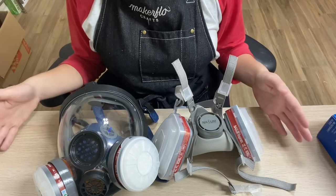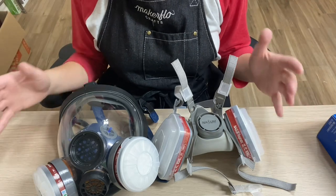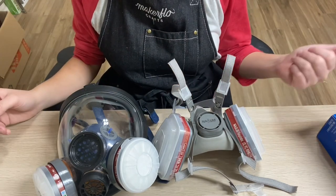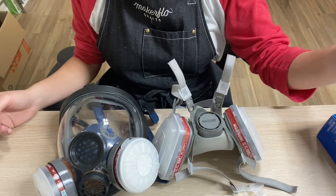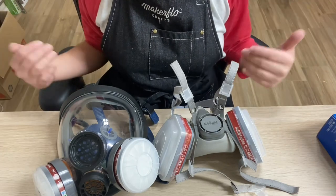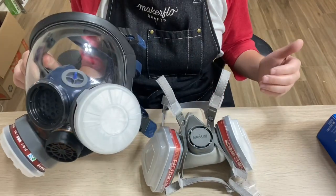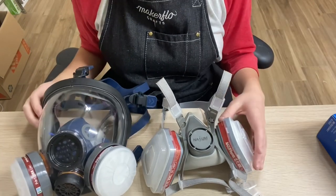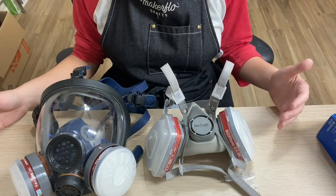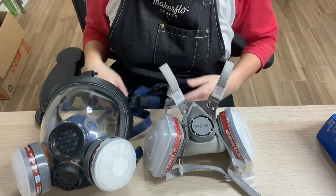While working with epoxy, a lot of people are either allergic or their skin gets aggravated. I invested in two respirator masks about a year in. I actually went to the doctor and was diagnosed with an upper respiratory infection, and they thought the epoxy caused it. So every time I epoxy — unless I'm making a video because you can't understand me — I wear my respirator mask. This helps tremendously. I would get a sore throat, feel sleepy, have headaches, and it turned out it was the epoxy. If the epoxy gets on my skin I don't break into a rash, but if you do, I would always wear long gloves, long sleeve shirts, and pants if possible to protect your skin.